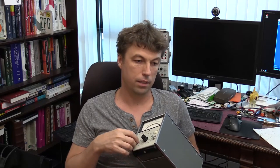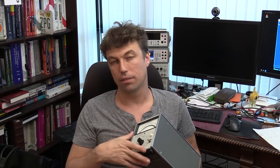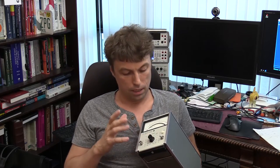And if you look for modern day parts such as AC components that are used in digital voltmeters, you'll find that the range of frequencies they support is limited; none of the parts I found actually cover the entire range from 10 hertz to 10 megahertz. And in addition to this, there are two more nice features that this RMS voltmeter has that I wasn't able to find in other modern digital voltmeters.